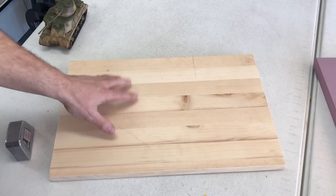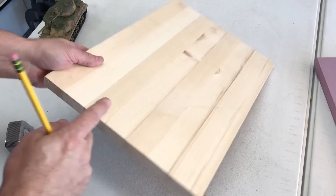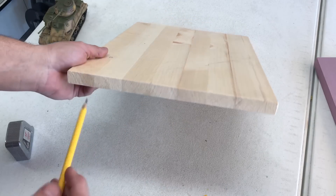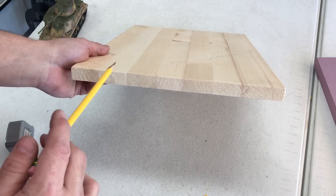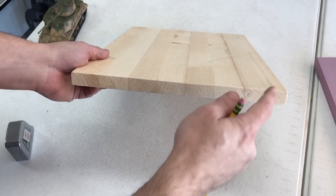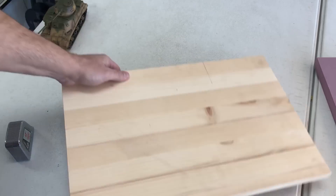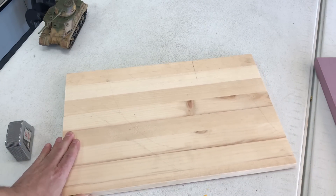I have my board all ready to go here. You'll notice we're not using a solid piece of wood but rather a board made up of multiple little pieces all laminated together. The main reason you want to do this is to keep the board from cupping. If you have one big long piece of wood, eventually through humidity or moisture the board would start to cup and make all the product want to pop off. When they laminate a board together like this it makes a nice strong flat surface.